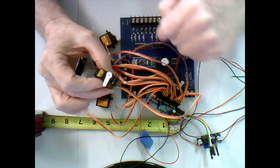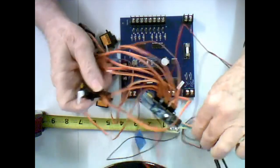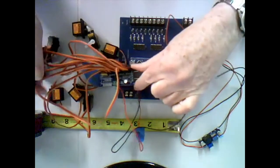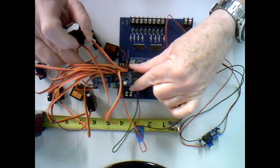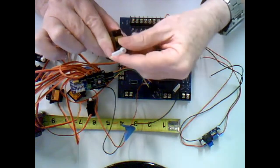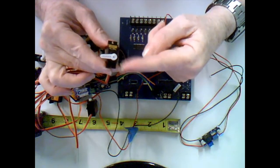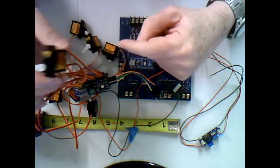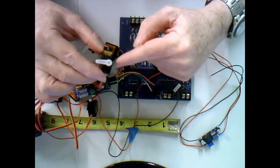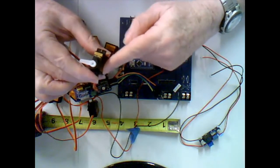So when that bit comes in to the Arduino, I have code in there that reads that and says, okay, convert that and send out on I2C over these 4 wires the command to control servo 1 through 16. And then I also send with it what I want it to do, how many pulses in which direction I want the servo to move, and I control that servo. And I've made a simple replacement for a tortoise motor. And I bought a dozen of these for less than 20 bucks. Okay, so you can see that I'm getting cheap.